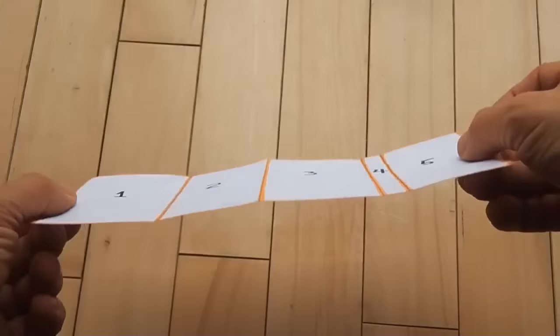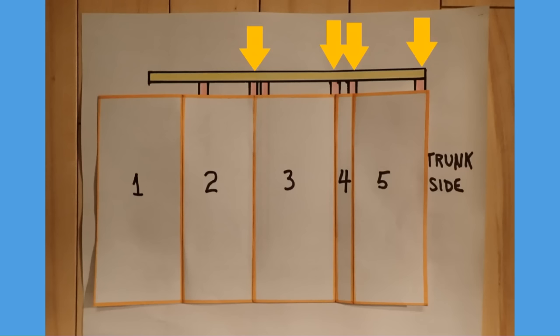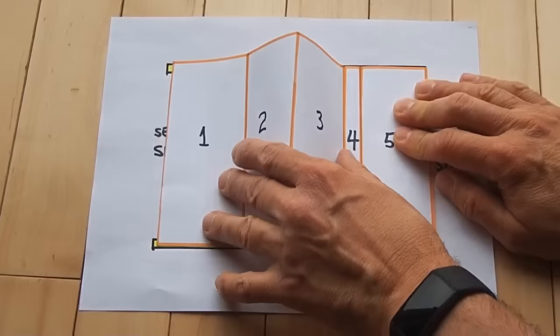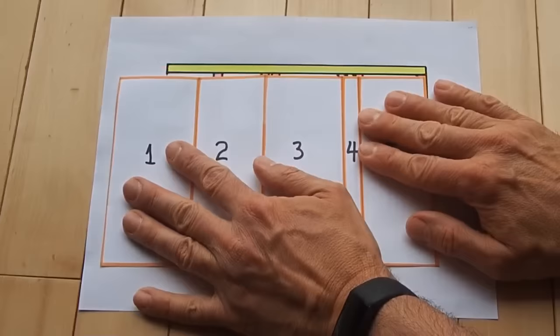Now look at the scale model and how the panel assembly is articulated. Here's the structure of the bed. You can see that there are two chassis side studs in yellow and six across studs in pink. Those six across studs are placed to support the piano hinge according to the position of the sofa bed — in a bed position or in a sofa position. We are going to look at that scale model in movement, moving from the bed position to the sofa position. Panel 5 is the trunk door to access the deep part of the storage. In the bed position, you can see that the hinges are aligned with studs for support.